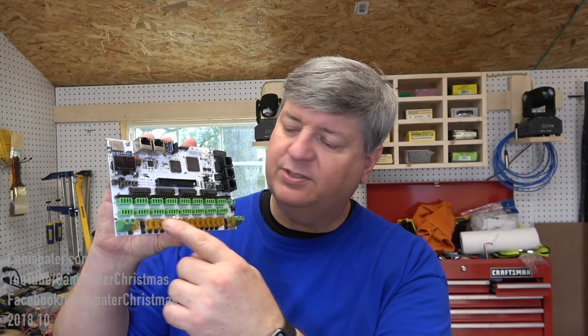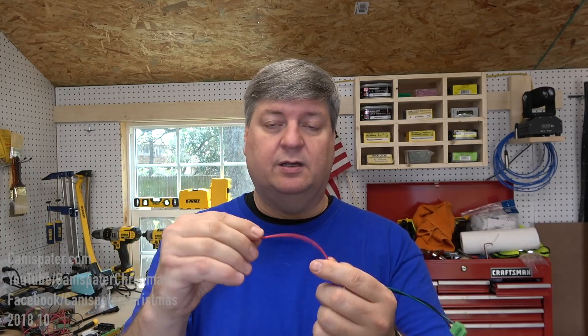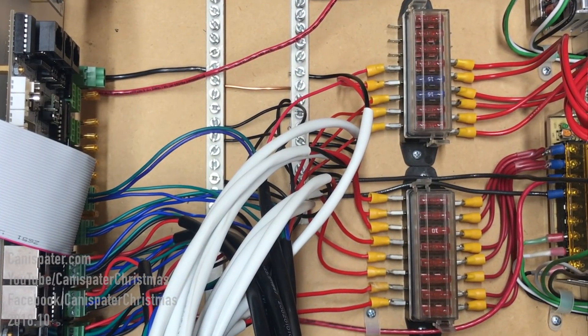That is the safest way for connecting up to here because you have the protection of these fuses. Sometimes I'll just use data and ground out of the controller and go directly to the power supply with the power lead. If you do that, go through a fuse. Chances are you'll be on a ladder, you short the wires together, and your whole show's messed up. So just put an inline fuse in here. You can get single versions where you solder it on, or something like a hex fuse from Hanson Electronics with multiple fuses, or a HeLa Fuse block with terminals. Just put a fuse inline — it's insurance if you're bypassing the power distribution on the board.